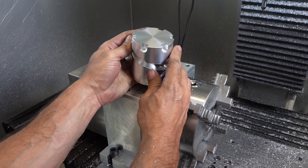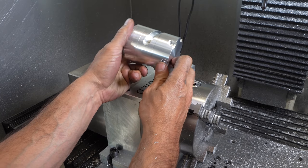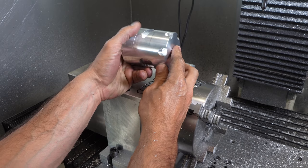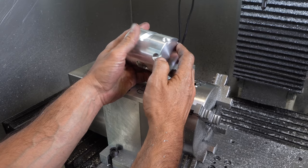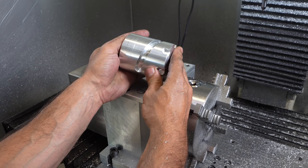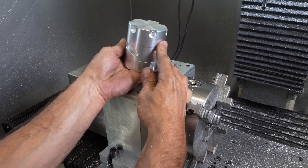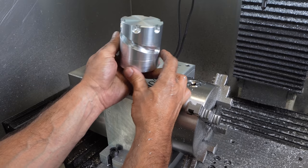And there's a lot of program optimization that has to be done, especially on my chamfer toolpath. And the Z-axis going back to zero every time it does this pocket. I'm assuming it's a safety feature in Fusion 360, but I will look into that. If someone has any tips and tricks, please do let me know. Other than that, we have this cool part